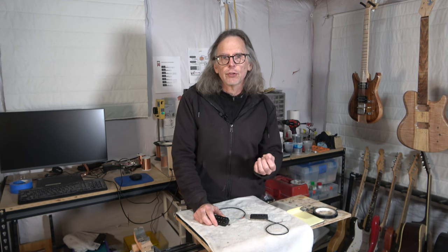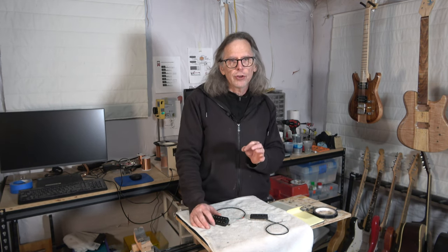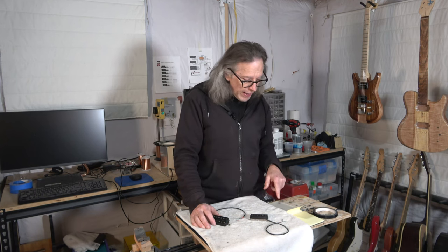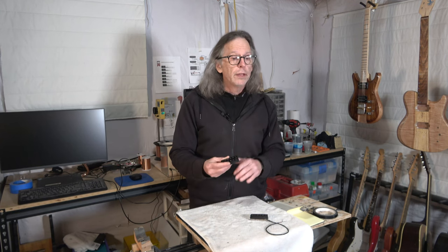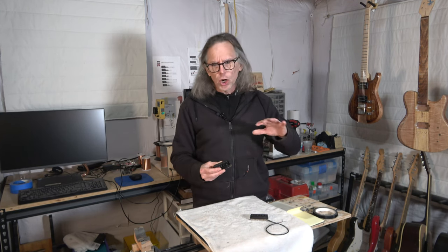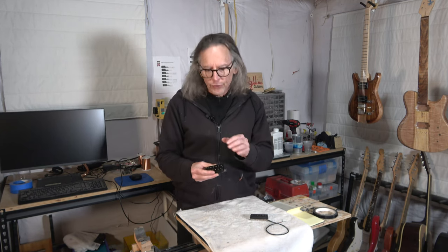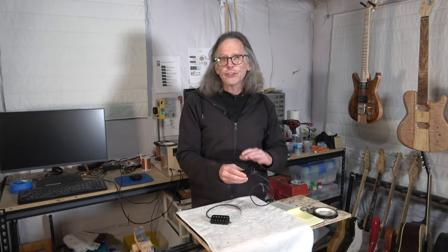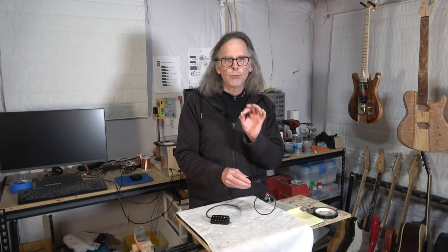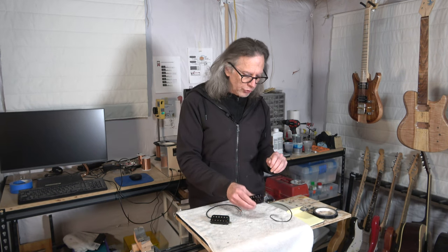It loses so much of the treble frequencies in the tone. So you can look at that number and get an idea of what kind of tone you're going to get from the pickups. And since the bridge is at 5.19 henries, it's going to be pretty warm. Typically, humbucker pickups are usually between 3.5 and 4.5 henries, so this is a little bit higher. The neck pickup is at 3.88, so it slots in right in the middle of where a typical humbucker is going to measure.